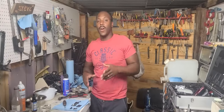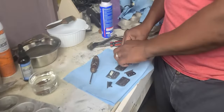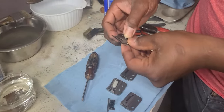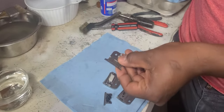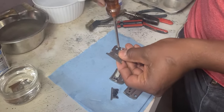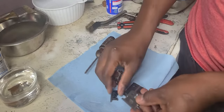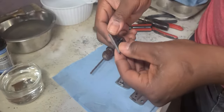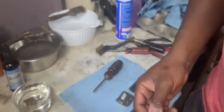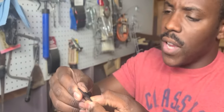All right. Now for the corded liners, you're going to get your blade. Of course, you get your blade guard, sit it in place. And remember, you're going to take the screws and you're going to screw them in, but not tight. You screw them in until they stop so that you can make your adjustment. And you're going to take your cutter, you sit it right there. And now watch me, what I have to do to make the adjustment. So you put the blade at eye level and you want to zero gap the blade.